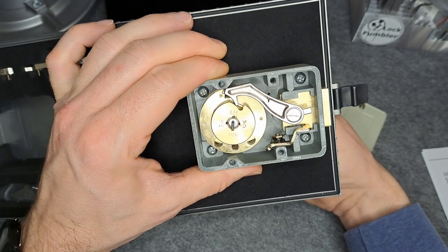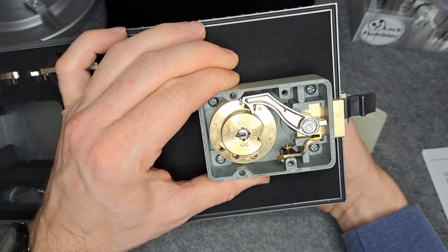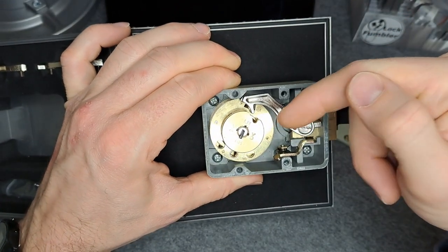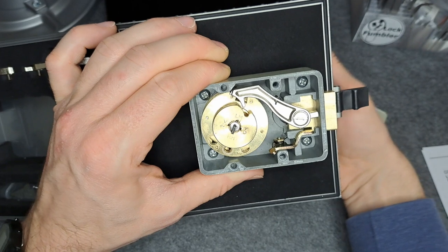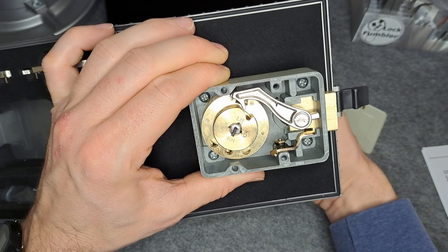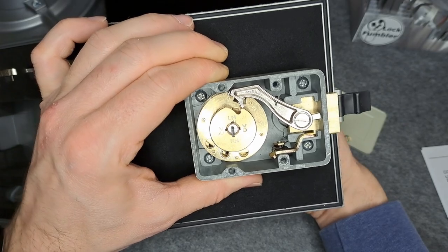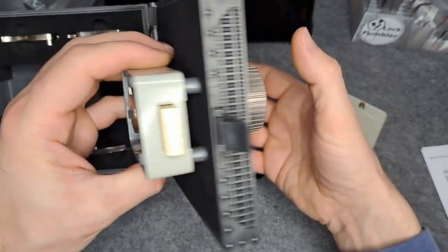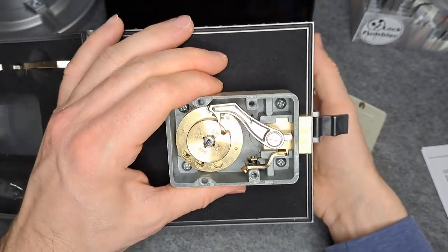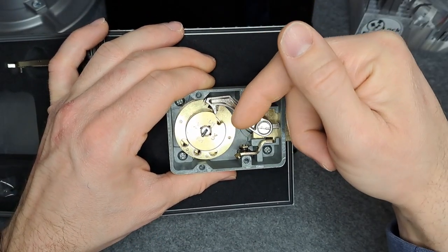So how do you crack a safe? Well, basically what you do is you try and feel how deep your lever is falling into the stack of wheels. So basically what you do is you check the contact points, like you check where this contact point is on your dial and where this contact point is on your dial. And this will change depending on how far your lever falls into the drive cam.